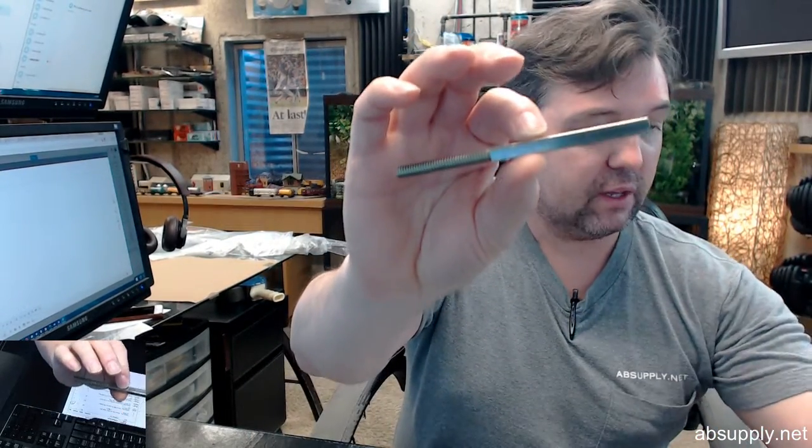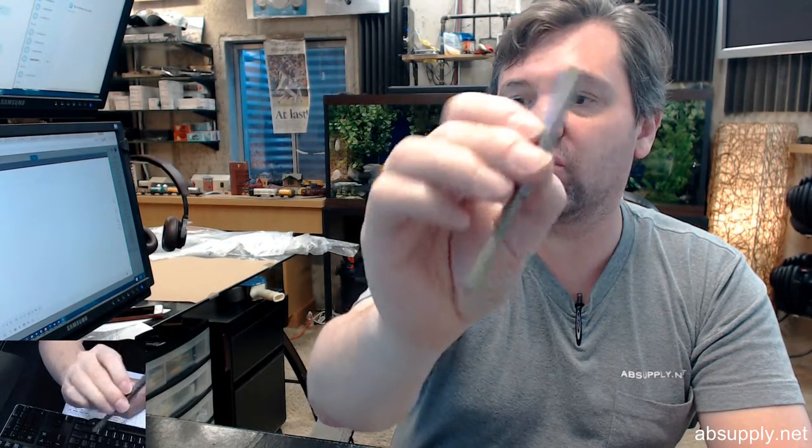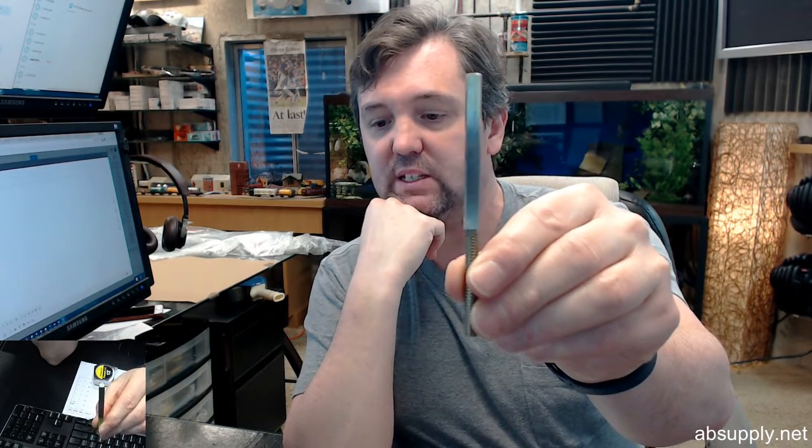In this video is to bring you a closer look at the Adams Rite number 26-0094. This is the upper bolt used in their concealed vertical rod series devices, the 8500, the 8600, and the 8675. And there are links to templates of all three of those device types down below. They're not templates as much as they are an exploded parts drawing, where you will be able to review not only the 260094, but all of the constituent parts that are available for that.